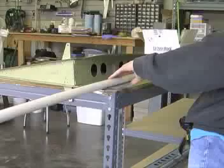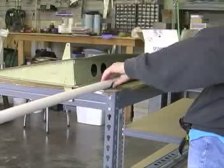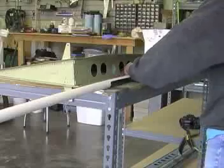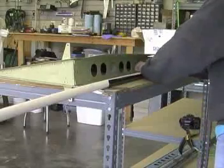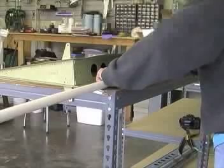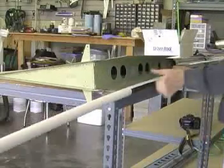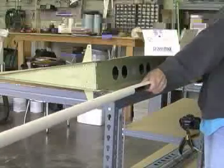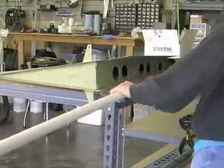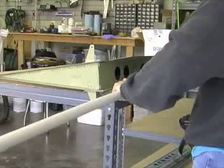I think your skin is going to be thicker than what it is on the rudder. This hasn't been too hard so far — the first section was easier because it was a shorter piece of metal, and the second one was kind of an eye opener. Make sure you run your crease for the outer skin before you start to roll, because I forgot to and we had to kind of unroll and get the crease in there, since the way the tool is set up I really couldn't do it from the other side.